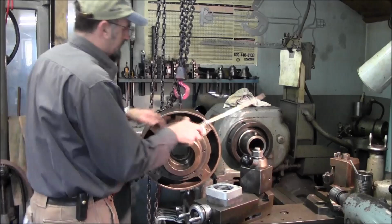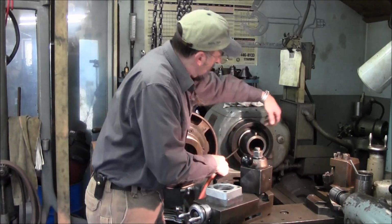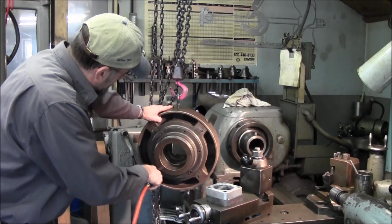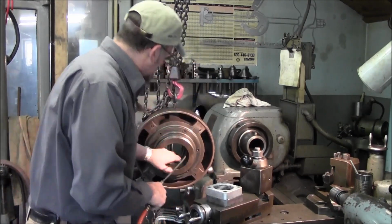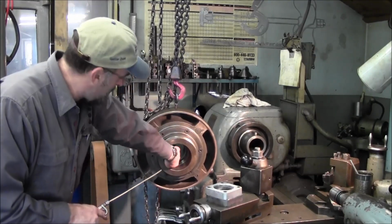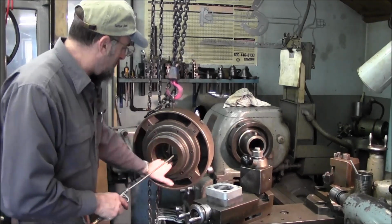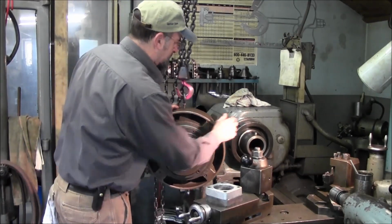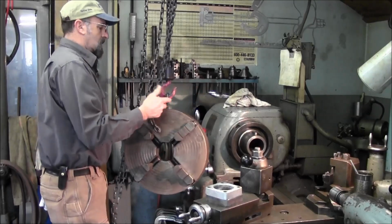Alright, so always make sure that nothing is underneath that slinger ring there. And also sometimes where the adapter bolts to the plate, there's a little gap in behind there. Make sure that you don't pop a chip up out of there and get in between here. Alright, it's always a good thing, bare hand, to check it. Alright, then you know you're good to go.